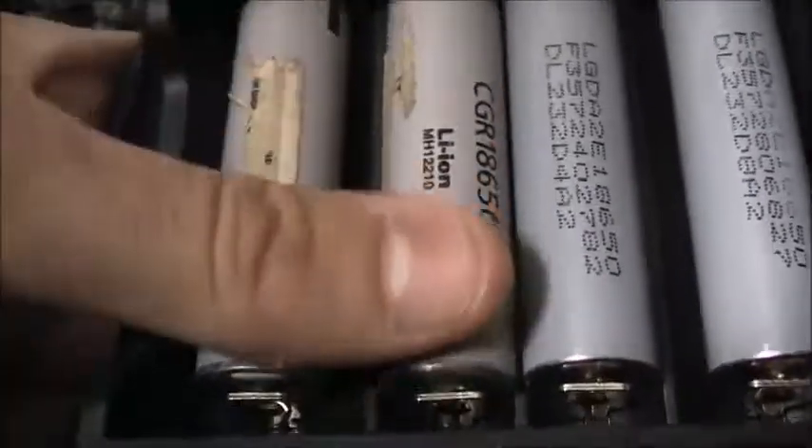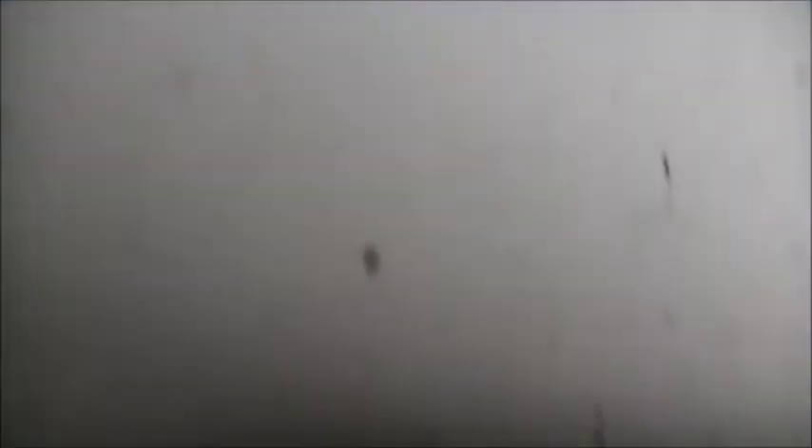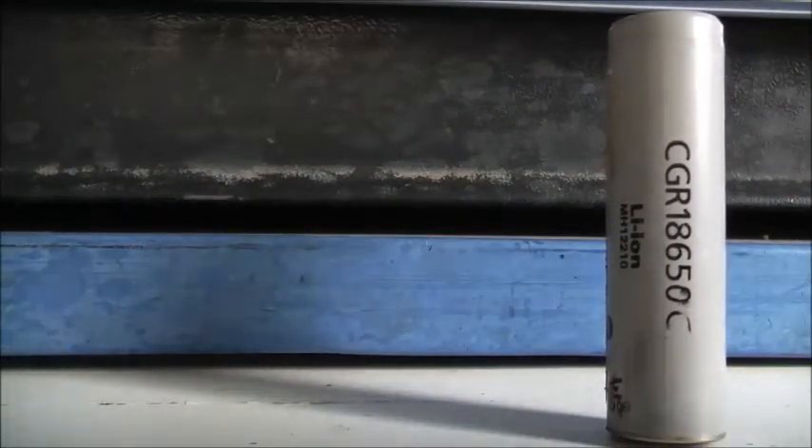It's just cycling this battery here. This one here might be too far gone. I've soldered the bottom where the hole was — there was a tiny crack in the bottom where I ripped the tab off. It lost its electrolyte, that's what's damaged this battery. But success with the other ones, definitely. It does work now. That one's saved — give it a good hit in the charger. They've already recharged it properly this time, because obviously it mustn't have charged properly the first time. There wasn't a very good connection inside that battery to get a good charge. Now they've pushed the vent valve down inside underneath there — it's repaired it. It's actually passing current now.